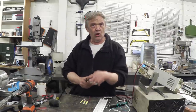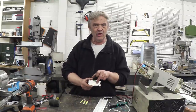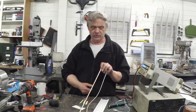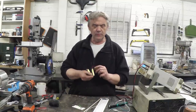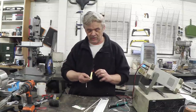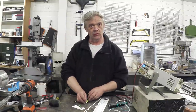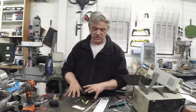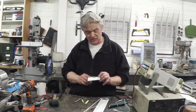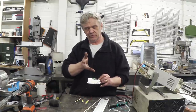We can get loads of them all in a block really easily. These three types: one where they're all individual and put on a circuit board; same thing again on a circuit board; and the newest type, called chip-on-board, or a COB LED — where each little chip is placed on the board and the phosphor is applied as a big coating over the whole lot. They're really much cheaper. These individual components — this one is made to run on a battery, so we've got a plus and minus, and a massive current limiting resistor.